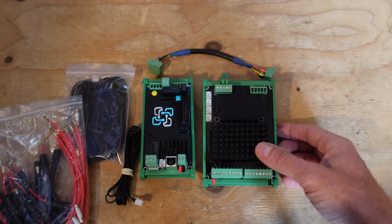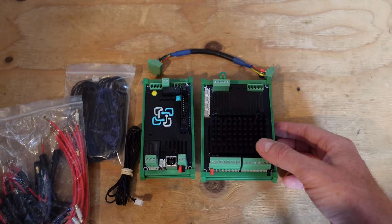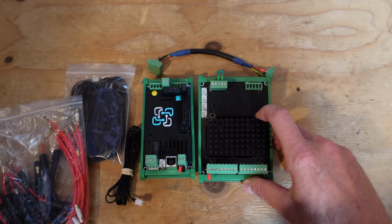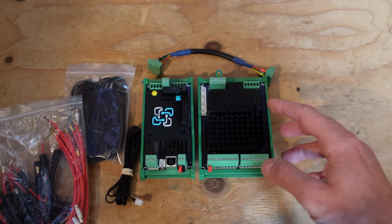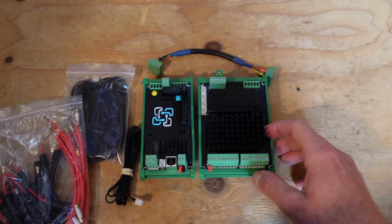So these Watchmon K9s can be daisy chained the same way an MM8 can on the Watchmon 5. The Watchmon Core currently supports up to 6 of these K9s. You can add additional K9s past 6, however Batrium recommends using an external 5-volt power supply at that point.